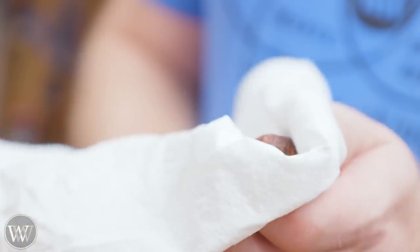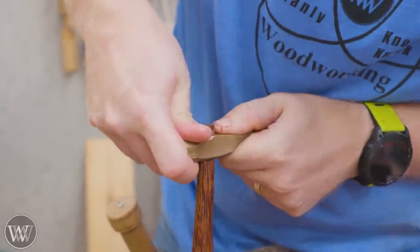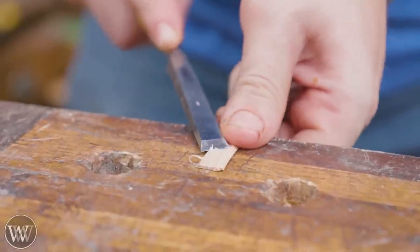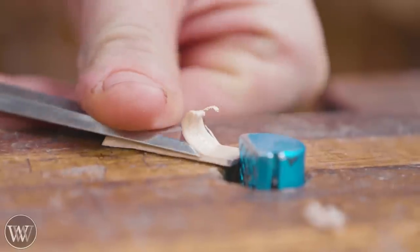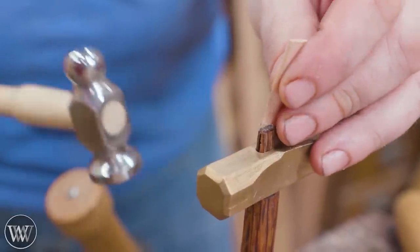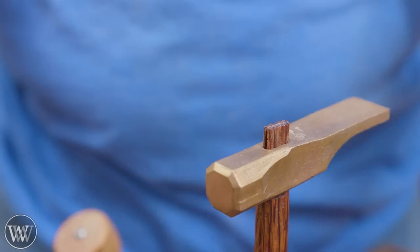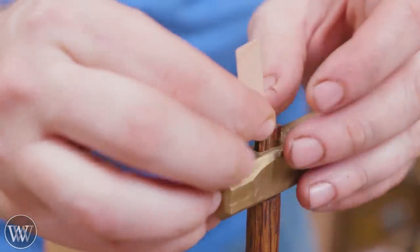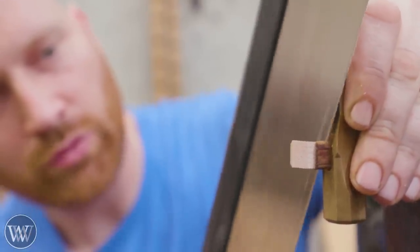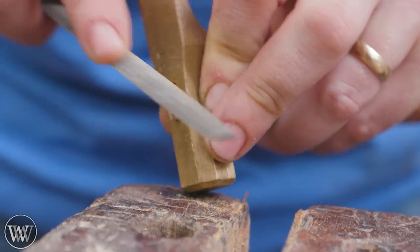The guy I'm making these heads for actually wants to do some more work on the heads, so I'm not going to hang it or put the face on - I'll just send them to him. However, for the small one on the palm, he wants me to make it. To hang the head, we need a wedge, and we have all these little split-offs that came when we made the tenon - we chiseled them off. It's easy to hold it and shave it down or put it into a dog - and it's aluminum so the aluminum will dent up and not the chisel. Sometimes you get lucky and can just put it on the wedge and drive it in, but if it's too tight you can come in with a chisel and just open up that mouth a little bit, then put in the wedge and drive it down. Drive it in until it gets to the bottom of the slot, then cut it off to the right length and trim it down. Use a chisel to shape it close and then smooth it off with the file - that's how you hang them.